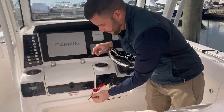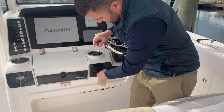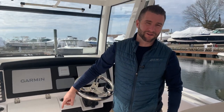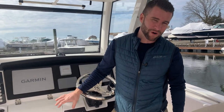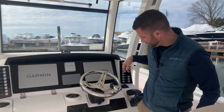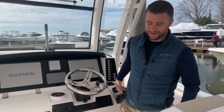Next, make sure your key lanyard is installed. Your boat will not start without that lanyard — the motors will crank and you'll get an error code on your gauge, so you really want to make sure you have your key lanyard on. Once the key lanyard is on you can tilt your motors down and fire them off. I like to do that first and let the motor start running while I'm getting equipment on the boat.